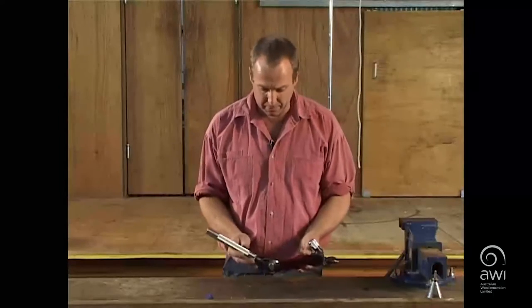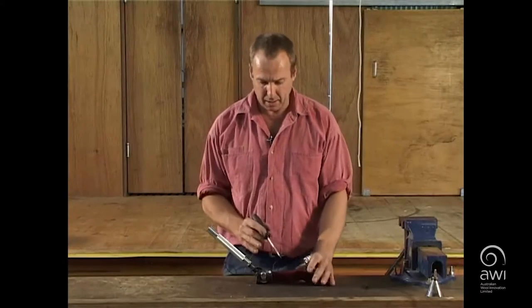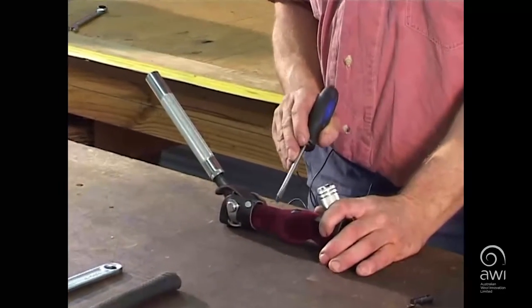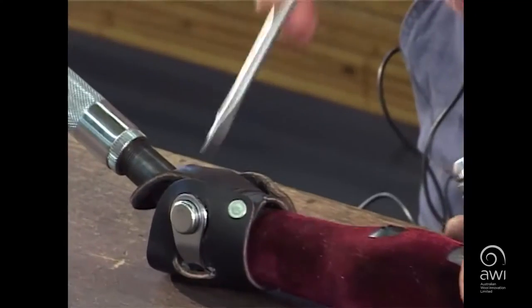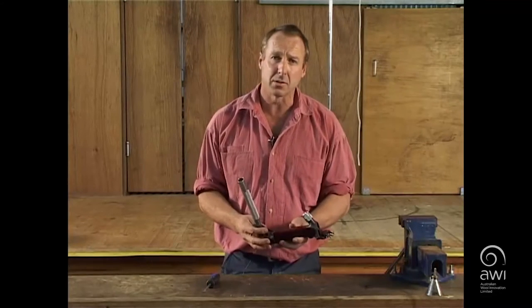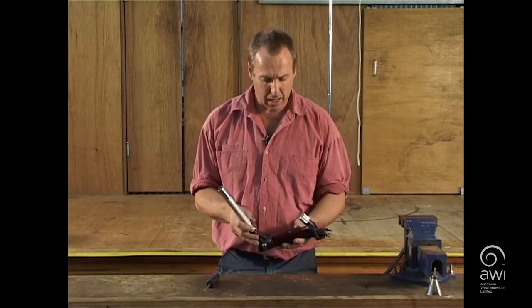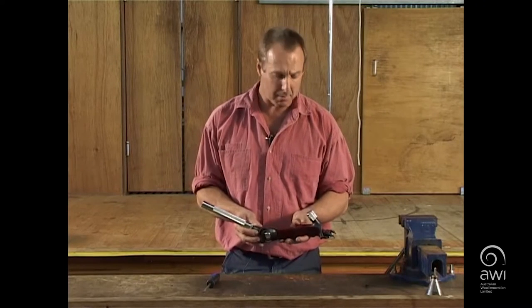We have different design features from other handpieces in that we have a four-bearing system. We have one bearing there, another bearing here, here, and in the back joint. Also, we have a grease point in the back joint, so it allows for a better, longer-term lubrication, which will relate back to longer-lasting longevity in the life of the handpiece.